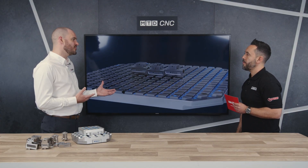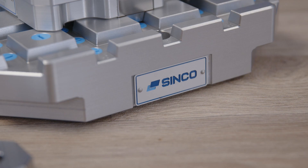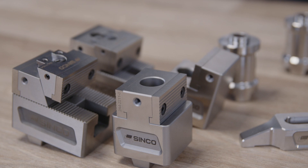Normally people would be used to seeing the conventional zero-point receiver with the pin system. Synco works on conical slots, and instead of having two, four, or six zero points on an entire base plate, every intersection on the base plate is a zero-point location. The centering elements on the base of the pallet — or you can have them machined into your existing workholding — use the tapers to achieve the location, which gives not only the zero-point location but also rigidity in X and Y, so there's no possibility of any twist movement whilst locating your workpieces.